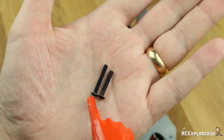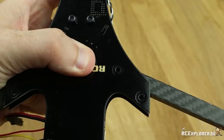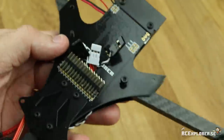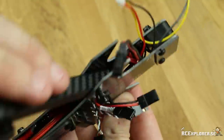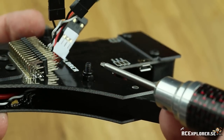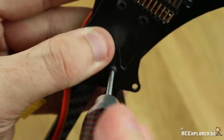Now find the only two 20mm screws in the kit — they're going to be used to fasten down the carbon fiber arms, and you need to shove them through from the bottom. Take care so you don't squeeze any wire inside of the tube. If a wire is in the way, use a 2mm Allen wrench and slightly jiggle the cable until it moves out of the way. Now put on the lock nuts. It's very important that everything can move smoothly without binding and that no cables are squished anywhere — double check and triple check that before tightening stuff down. I used a 5.5mm turnbuckle tool to tighten down the 3mm lock nuts. Start by tightening down the front arms. If you used the correct 20mm screws, there will be a part sticking up — that's how we want it, because we're going to screw something into that later. Before tightening down the back arm, make sure it's in the right position: not so far forward that it's touching the pin header, but not so far backward that it's not in between the two screws.